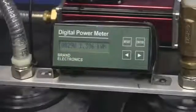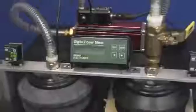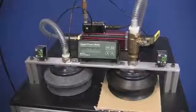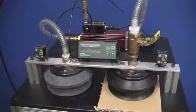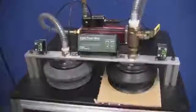It's a little bit ironic that in this state, the pump is using its most energy when it's doing no work at all. Also consider that any time the machine is paused, such as if there's a line stoppage or a mechanical jam or no demand on the machine, the pump is always running, very often in this position where it's using the most energy.